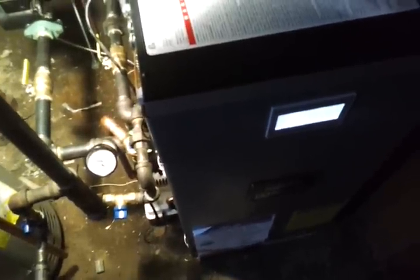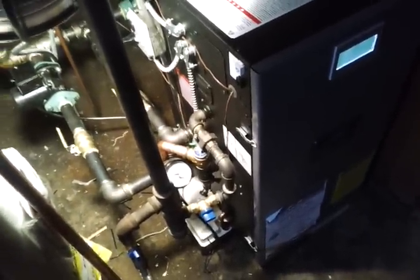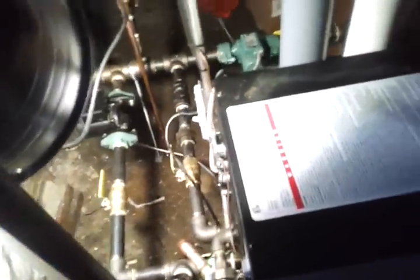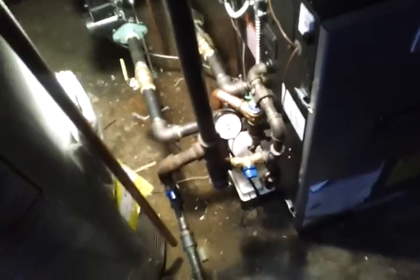Hello and thank you for watching. On this installation we've installed an Alpine 105 gas-fired high-efficiency boiler, going on an old gravity system as a direct replacement. The pumps are primary/secondary, which is typical for this boiler. This particular application was extremely constrained for space — it's in between a water heater and a wall with a chimney right next to us, so we had to work both sides of the wall. It was a pain to do, but it came out quite well and I'm very pleased with the installation.